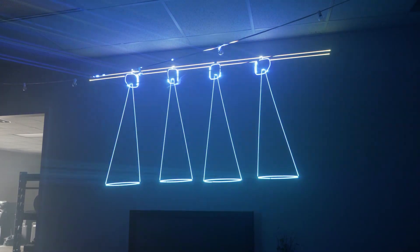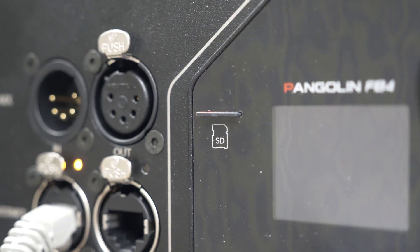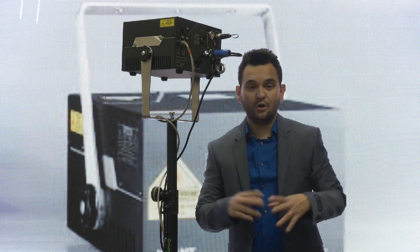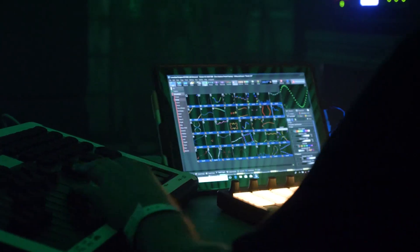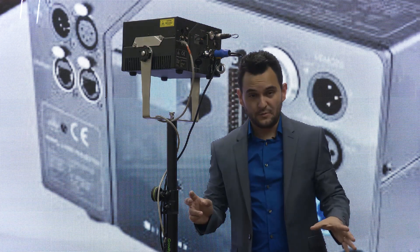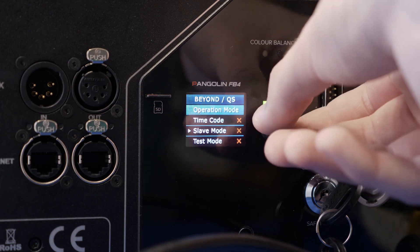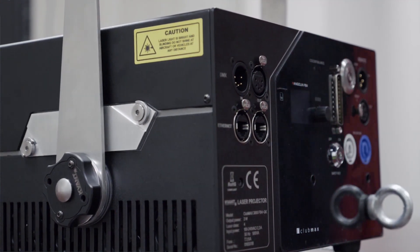You can control it live using the Pangolin software. You can go into the mode and actually save all your shows — including your DMX mapping — to an SD card and trigger everything directly from your DMX console. This is really good if your LD doesn't want to mess with laser software. You can pre-program the entire show, including your beam attenuation maps, your zones, et cetera, save them on SD card, and then trigger it from any console, whether it's basic DMX software or more advanced systems such as Hog or MA. And if you're using this for digital signage, you don't even need a computer or DMX console at all — you can trigger everything directly using the FB4 player and the SD card reader. Essentially, the ClubMax series with the FB4 is a laser projector with a media server built in.